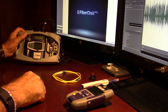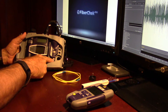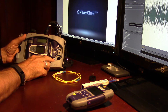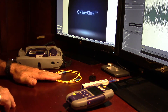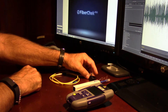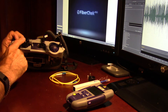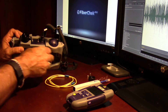Next up on our test bed is our ever trusty HP3. This is the fiber inspection kit. We have our analog FBP probe — this is the Westover 5000. The HP3 is the power meter and connector inspection as well as jumper inspection on this camera. That's pretty much our test bed. We have a short LC cord and our ever popular one-click cleaning tools. The HP3 is set up right now for the 2.5 — this is a standard push-pull type connector with a 2.5 millimeter ferrule. The LC connectors we're going to do are 1.25, so we have to reconfigure this.